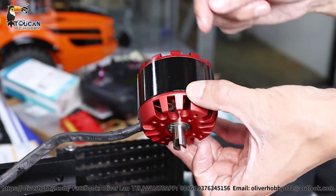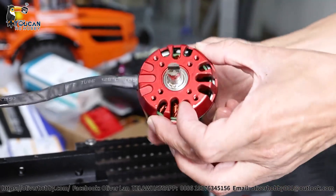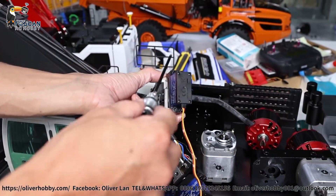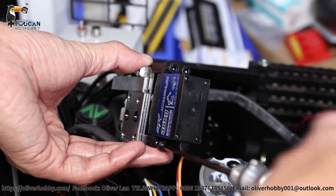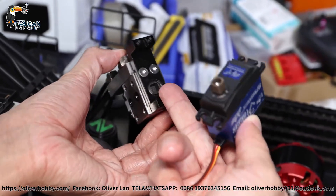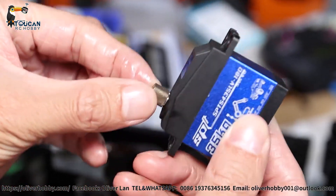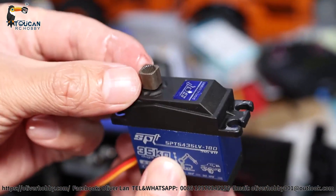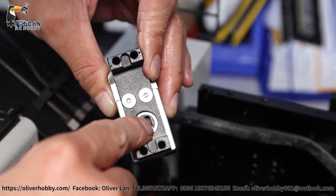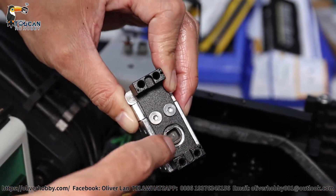With a good ESC and these big, good motors and industrial pumps, they will not easily get broken because we are only using less than half the load. For the three valves with three servos — if you need to change a servo, only four screws per servo to remove. The servo can be disconnected quickly. Four screws removed and this one can be directly pulled out. You will see it has a square connection to the valve block — this square one has teeth inside for the servo shaft to bind together, and this one is a steel one.